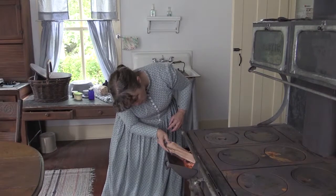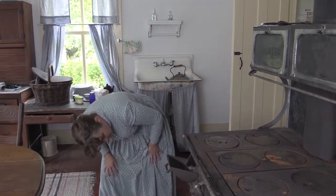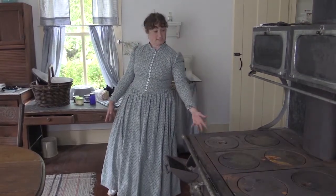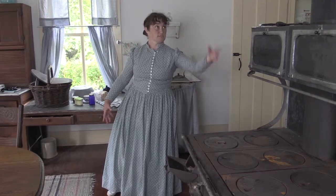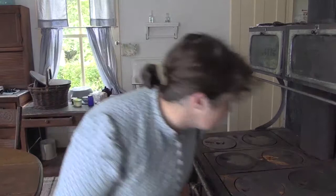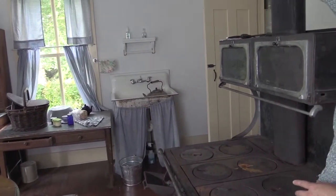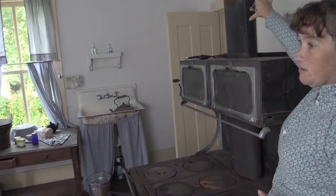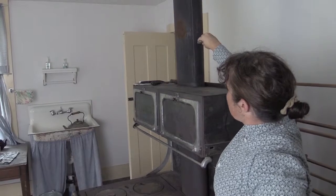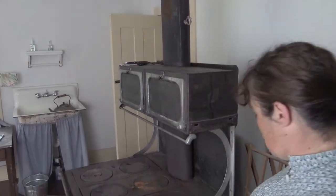And usually the first time you light up a cook stove, you're immediately going to discover where all your drafts are, and if you do or don't have them open, because it's going to start to smoke out the top until it starts to draw. So you've got the 2 side drafts, you've got one on the stovepipe in a lot of stoves. And how you tell with these plate drafts is there's a big round plate in here, or oval plate, and it is pointing in the direction your flipper is. So if it's this way, it's closed. If it's this way, it's vertical, it's wide open, it's going to let that airflow come up the chimney.